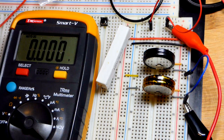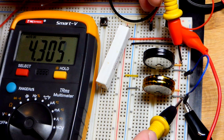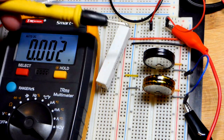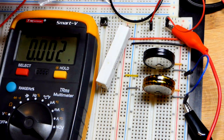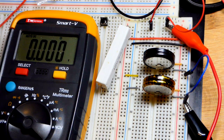Now I'm going to measure voltage at the rail or the supercapacitors — the positive and negative rails on both sides are directly connected. You can see we actually have a little bit of a voltage rise. These are polarized supercapacitors, and when you discharge polarized capacitors and then suddenly take a load off so they have very high resistance, their voltage tends to drift back up a bit toward where it was before. I forget the technical term for that, but it's really common with polarized capacitors.